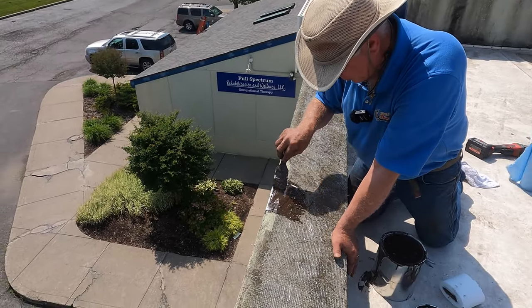It's not even going over the drip edge — this is a big problem. It's all open here and it's open there. It doesn't matter what you do, it's leaking right now. Don't take all this off — just make a transition from about halfway. You want to prevent it peeling up here. Make a whole transition onto the metal — see it's leaking there, getting underneath. Look at the water trail there in the dust. Make a patch here with a fleece.